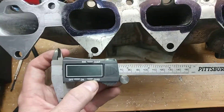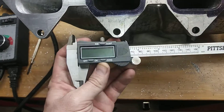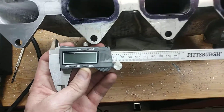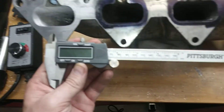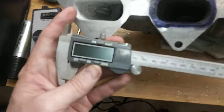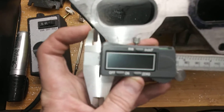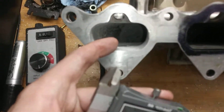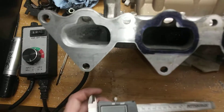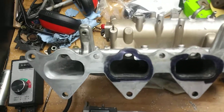Just to show you the tool I use — it's just a Harbor Freight caliper, I think it's like $8, made by Pittsburgh. When I did the entry measurement I just used the caliper, but to go in an inch I actually had to use a telescoping gauge. I'll show you how I did that here real quick. Here's my set of telescoping gauges — they are made by Mitutoyo. Feel free to look those up; it's an older set.